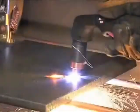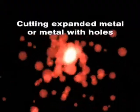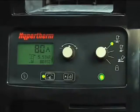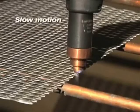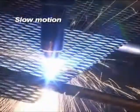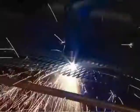To prolong the life of consumables, it is recommended that the angled method be used to minimize damage caused by molten metal blowback. To cut expanded metal or metal with a lot of holes or gaps, set the mode switch to expanded metal cutting, which is the top position. This enables the system to automatically re-initiate the pilot arc without re-triggering. To cut, simply follow the same procedures as outlined for plate cutting.